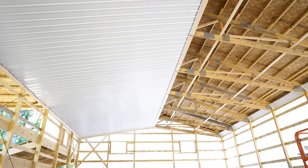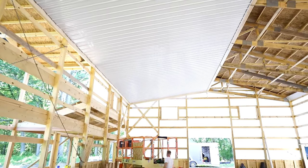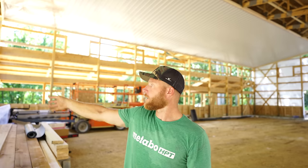There's no doubt in my mind that by running our steel like this up to the peak instead of running it long ways like we always have done, it's a lot more work - it was a lot more framing, a lot more layout - but Greg and I both agree that once we started installing the steel it went extremely fast and we're loving the look of this. Time costs money, labor costs money, the extra framing costs money, but if the look is what you're after, especially when you're doing that raised bottom cord scissor truss like this, I think it adds a lot more depth to that ceiling. We can't finish this section over here because we still have to build the chimney on the interior, so we're just going to leave those sheets off, get that chimney built once the concrete's done.